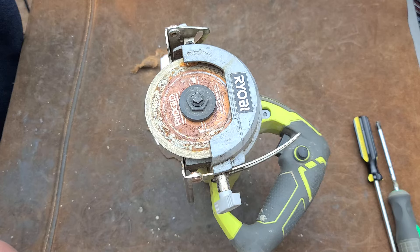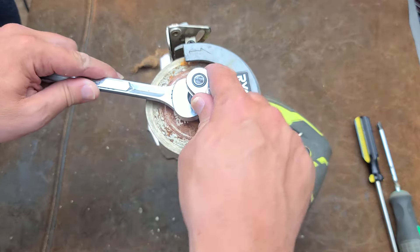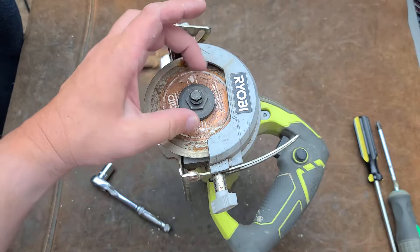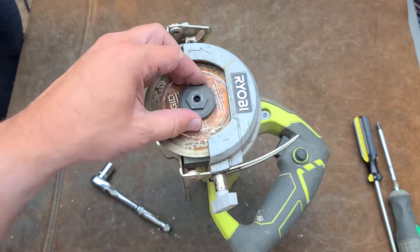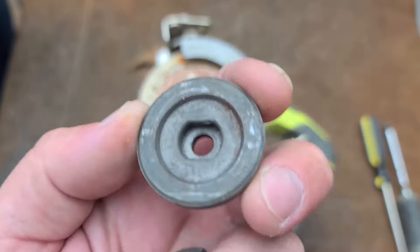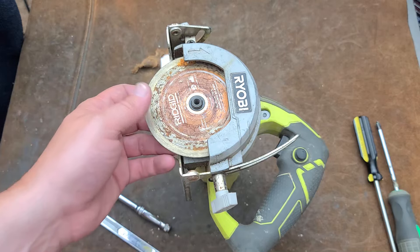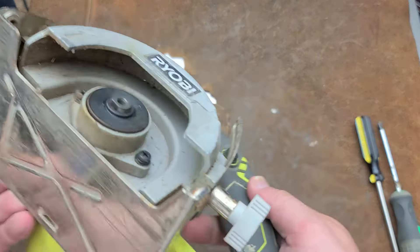Left-hand blade, so it's more optimized for right-handed people. It doesn't actually have a spindle lock — you're literally supposed to use it this way. Since it's a left-hand blade, it's going to have a left-hand thread, so this bolt unscrews in the wrong direction. As you can see, I'm turning it clockwise to get it out. So it's a left-hand thread bolt for a left-hand blade. It's keyed, so the power is delivered through the shaft into this outer washer, and the friction — just like so many other saws — is how it drives itself.